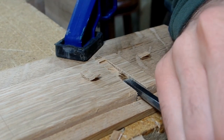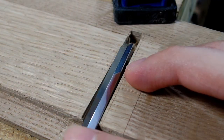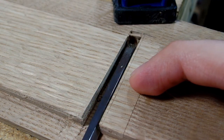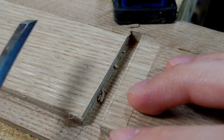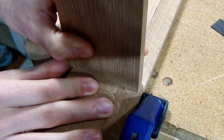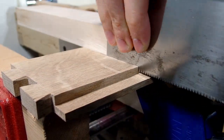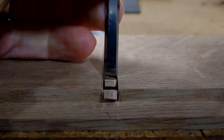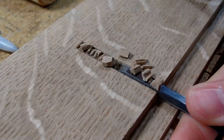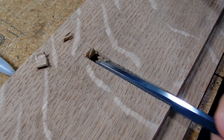After cutting the sliding dovetail, I could transfer the tail to the cabinet side and focus on cutting out the pinned portion. Using the same angled block of wood as a reference again, I could establish an angled cut line on either side and then go in with a chisel and cut out the waste. Once the sliding dovetail was complete, I could use a very similar process for cutting out the stopped dados for the shelves, which was a little easier because I didn't have to deal with any angles.